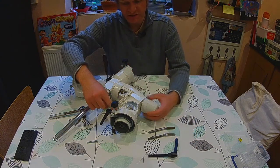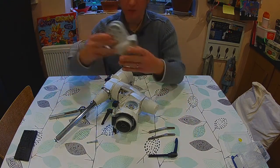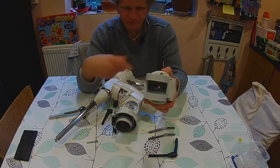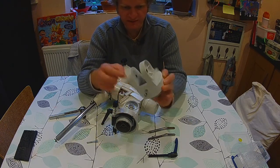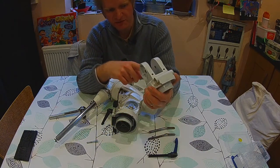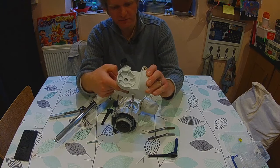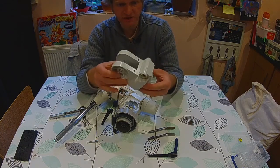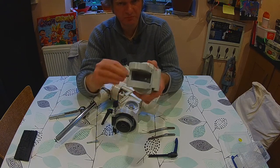This side I've already done, so this side is actually fine — this is the M8 side. The new mounts have an M8 there and an M10 there. Because all of my mounts are second-hand, I find that lots of bits and pieces have been broken. You can see quite clearly that this pin has been bent in. So at some point I'm going to have to either bend it back up and cut it out, or cut it with some kind of saw and then unscrew it. That part is salvageable, but the screw is jammed in and you can't screw it at all.